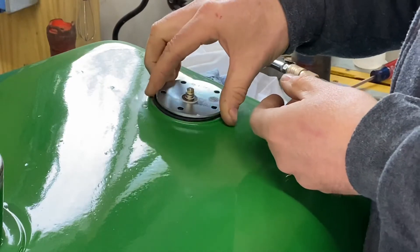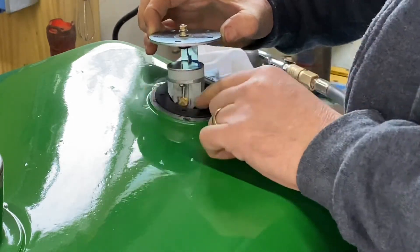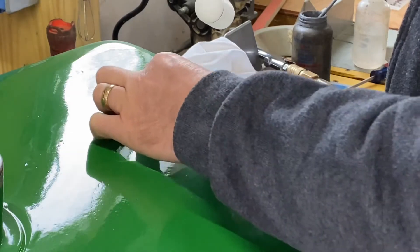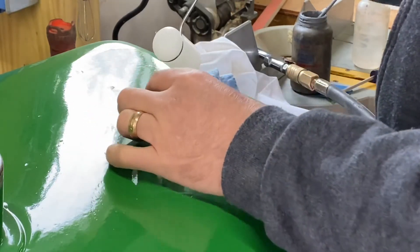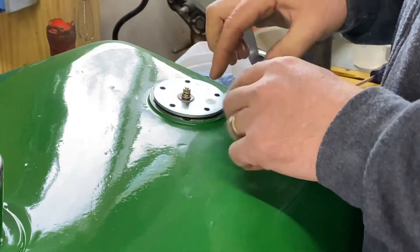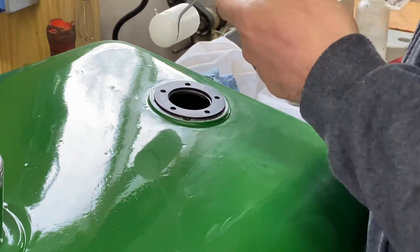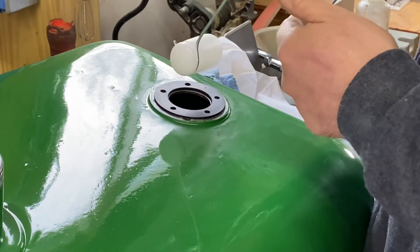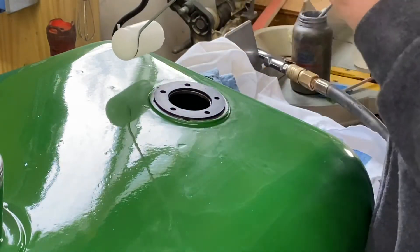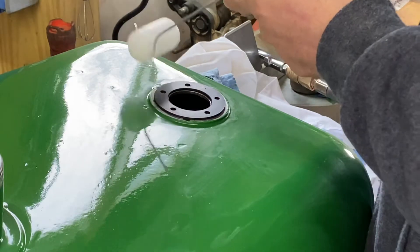There's the finished product. It's very thin metal, so getting that welding bead to lay down is not an easy task, nor is it necessary for this application. I'm not worried about these little runs — that's not going to bother me at all. This is probably barely going to be seen from under the hood. The hood itself came right down to the lip and was bumping it a little bit trying to get into place, so by having it a half inch higher it was giving just a little interference — that's why I did this.